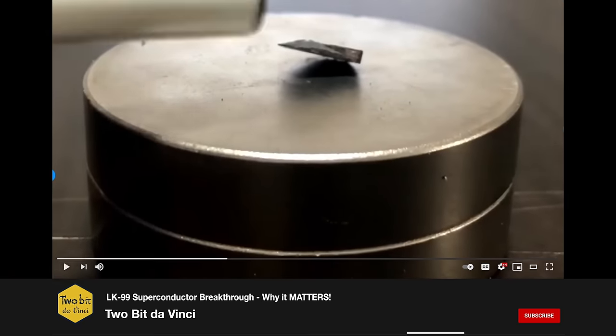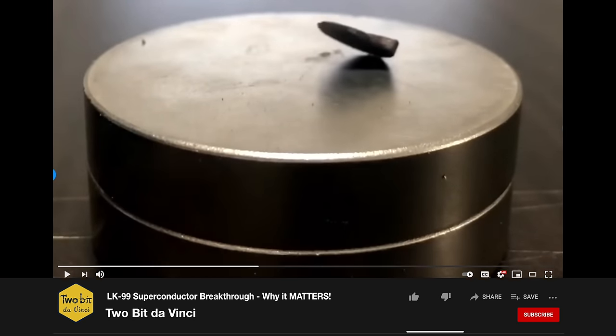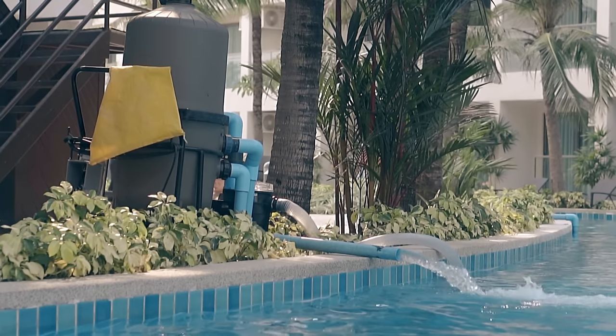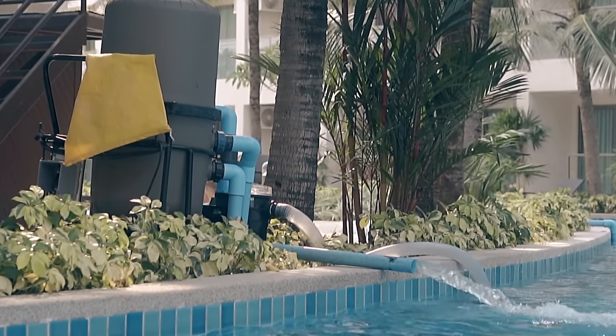We do need very high magnetic fields, so we need to use superconductor technology, which isn't cheap — but there is a really interesting new breakthrough. There are other issues with flow instabilities in some cases, and the overall physics is very complex, making predicting how these pumps will work rather difficult. These cons make these pumps impractical for pools or home water systems. However, there are many industrial applications that are a perfect fit.